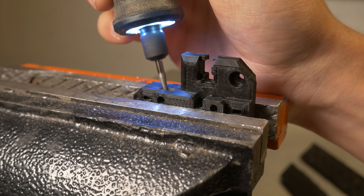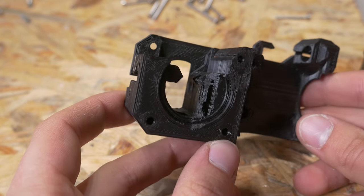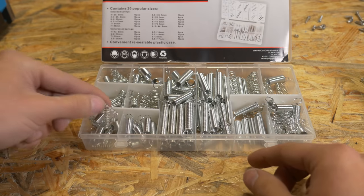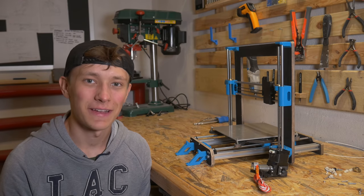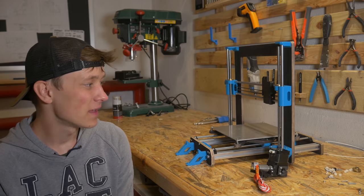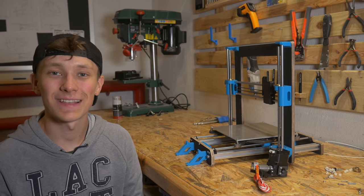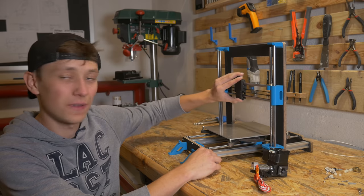I was pretty often using a battery-powered Dremel-like tool for sanding. There was a lot of sanding on the extruder because I used the same design as the Prusa i3 but with different parts, so I had to make it work. I made quite a big hole in the extruder just to fit the idler and the extruder gear, and I used a bearing from the old extruder assembly to press the filament. I'm really tired — probably eight to ten hours into assembling this — and figuring everything out with old parts is not easy, but so far everything moves pretty smoothly.